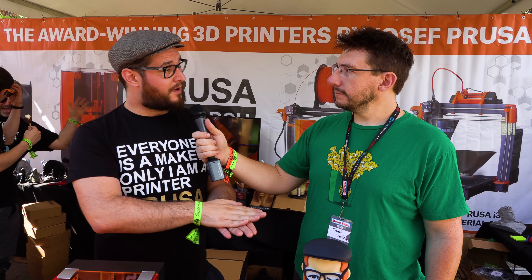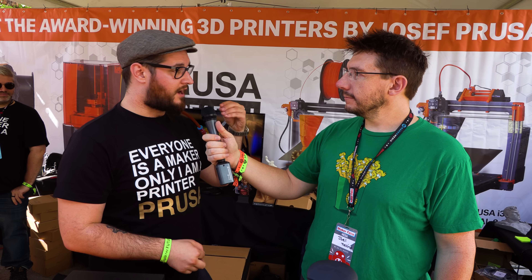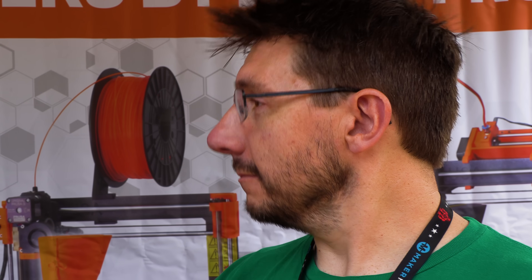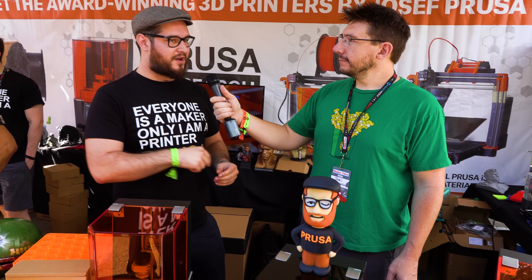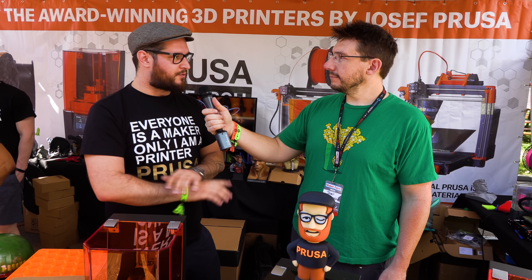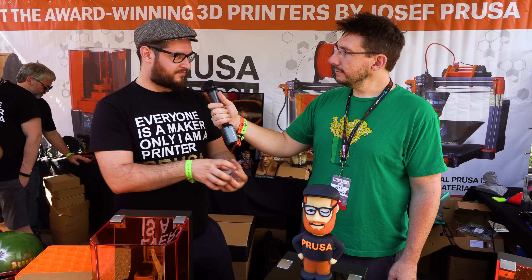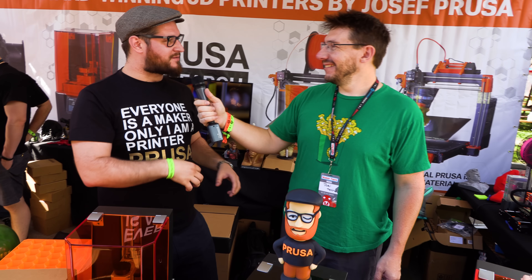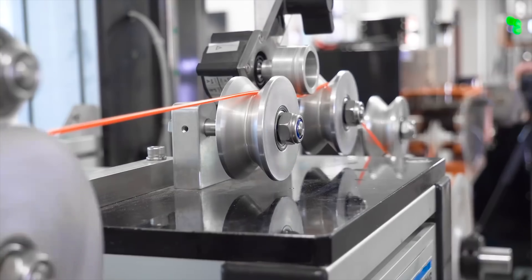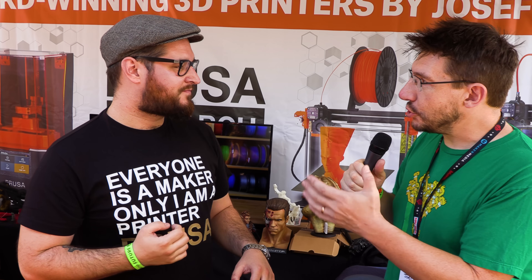Or when you have the top layer, you can have little holes in it, and it's very hard to calibrate. So we are aiming for 20 microns or better. We have a beefed up server with seven cores doing analysis of all the data, and if there is a peak — if it goes out of spec — the spool is rejected. And because the whole line is robotized, automated — we have robotic arms handling the spools — there is no way it could get to the customer.